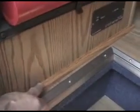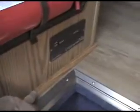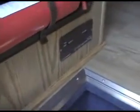Well, before we do, since we're right here and I can get pretty good light, you'll see right here this molding that I installed that I talked about in the Flooring 1 video. Of course, it has tape on the back, tape on the bottom, and then it's got nails on it. And then I came back and glued it, and caulked it top and bottom, so it's sealed real good. Now, if I get a little closer look, that's the same shoe molding that's inside the entire RV. And that's just red oak stained to match everything, and then urethane.